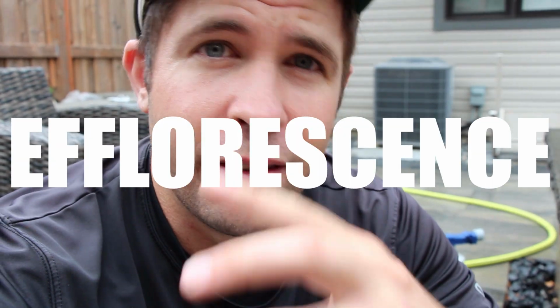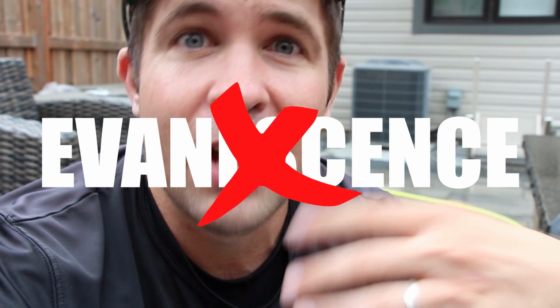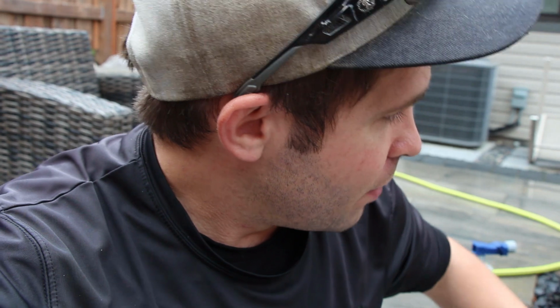And we do have a video of this on our channel. If you want to go into the channel, search for efflorescence, not effervescence, not evanescence, efflorescence, and be able to see what this is. Essentially, it's just minerals in the concrete working its way to the surface because moisture is in it, and moisture wicks its way to the surface, bringing those minerals to the surface.